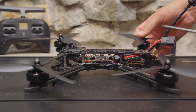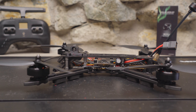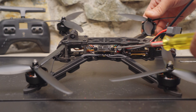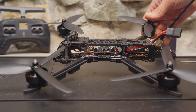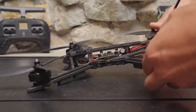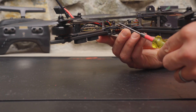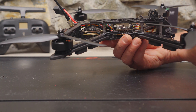The stack is GEPRC's F405 HD version 2 with 50-amp ESCs. Even though it's a budget stack, it's a pretty good option because it has the F405 processor so you don't have to worry about compatibility issues. It has plugs everywhere including a DJI plug, so if you pick up a digital system with a 19mm camera it's literally just plug and play. It also has six UARTs — I had no problem installing my GPS unit — plus USB-C and 16 megabytes of blackbox storage.